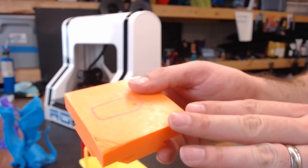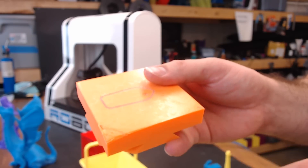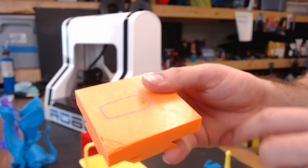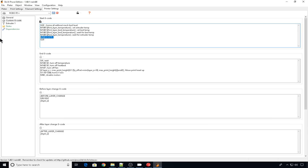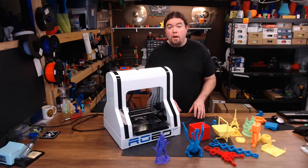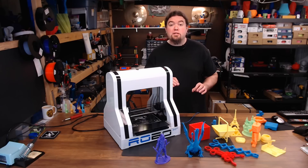I also made this dovetail box, and I wanted to show you that the corner lifted up. That's what happens if you don't get the Z set up just right — it's not going to level correctly and you'll get some spots where it lifts. Robo uses an M565 command to help you set the Z offset; you have to put this in your start G-code. I've found that a Z offset of -0.75 is just about right for this machine. If you don't get that Z offset right, you'll get prints that curl or prints with elephant foot.